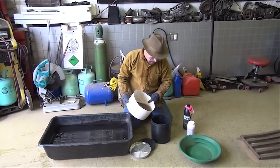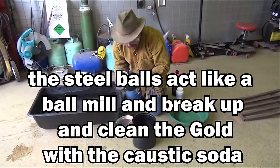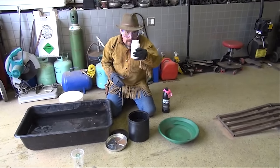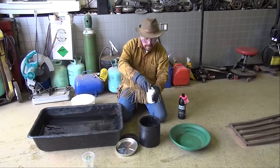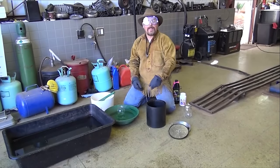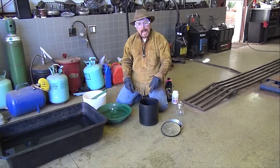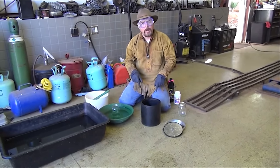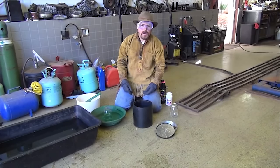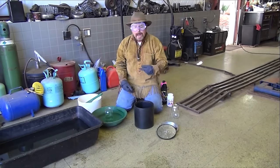You're going to dump the concentrates into the drum, then take your 20 balls and dump them in there. Take a tablespoon of lye and dump it in there, then take it over to your tumbler. After letting it tumble for about two or three hours, drain off all that nasty lye and put in fresh water. You can put the mercury straight in with the lye and tumble it that way — a lot of guys do that and it is very effective. But I like to rinse it out and get some fresh water in there before I put my mercury in. Either way works.